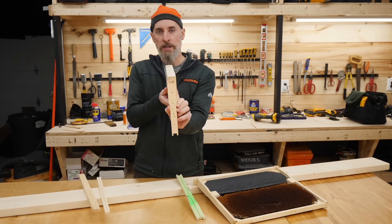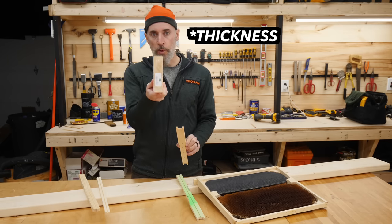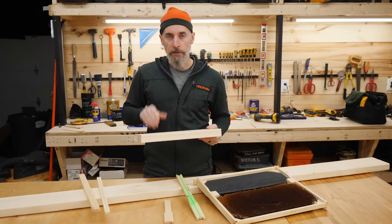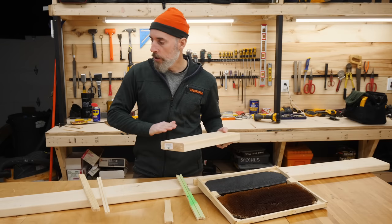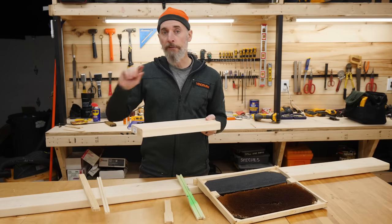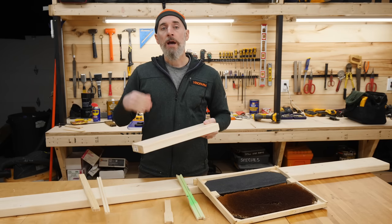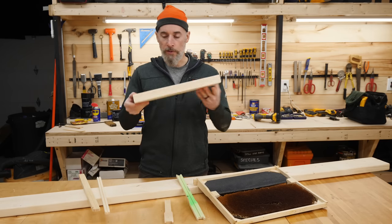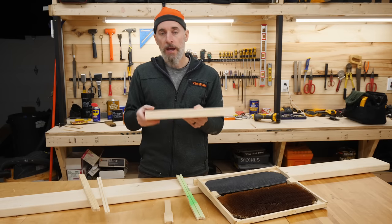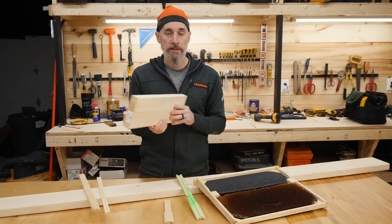We're cutting the sidebars out of blanks — this piece of wood here. I made these out of a two-by-six eight-footer. Now, a Langstroth frame is an inch and three-eighths thick, but a two-by-six is actually an inch and a half thick, so you have to take an eighth of an inch off the width of your board. If you have a jointer or planer, send your two-by-six through and take that eighth of an inch off to get it to one and three-eighths, then cut to length. I don't have one, so I cut these to length on the miter saw first, then took that eighth off on the table saw.